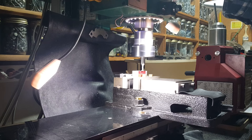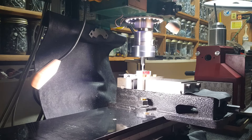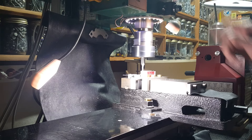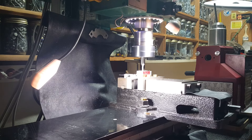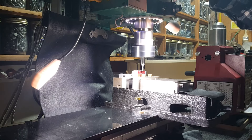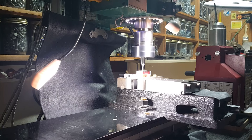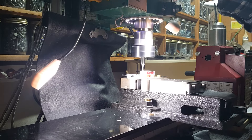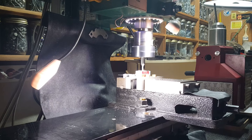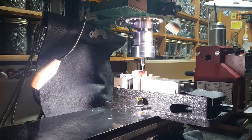Pretty good RPM. Going in 5 thou, start cutting. I gotta go over to the print because I forgot how deep I'm supposed to go — I think it was 0.180. These are nice end mills designed specifically for aluminum, though I'm sure there are better ones with a higher helix. Going to 15 thou, and I can walk to the side from time to time to give the chips clearance. Get the vacuum over here because I don't want chips all over the place.